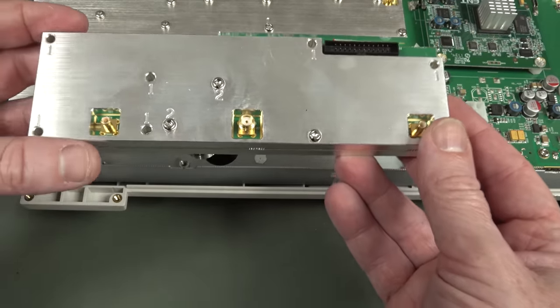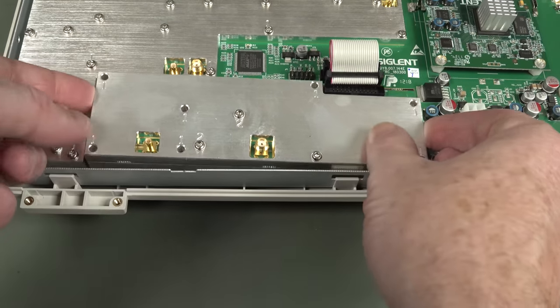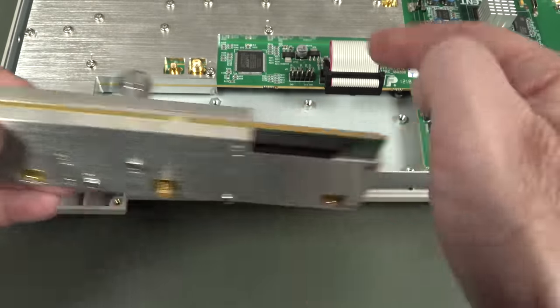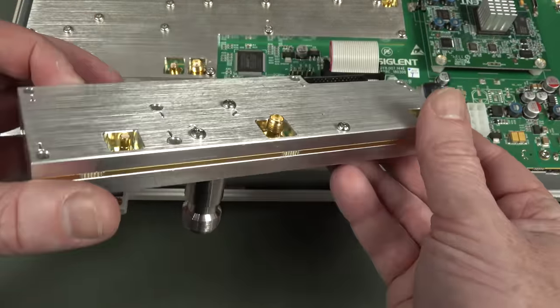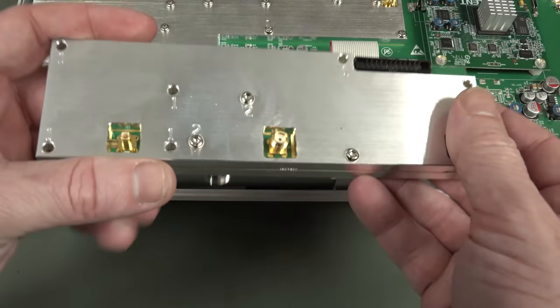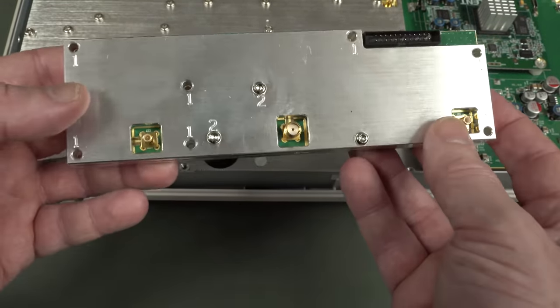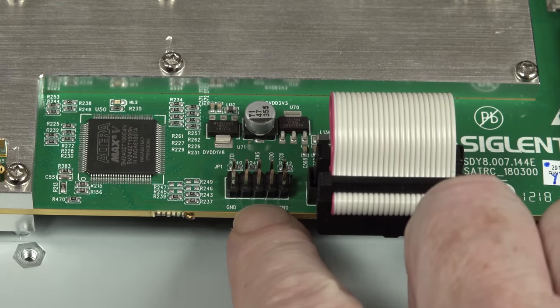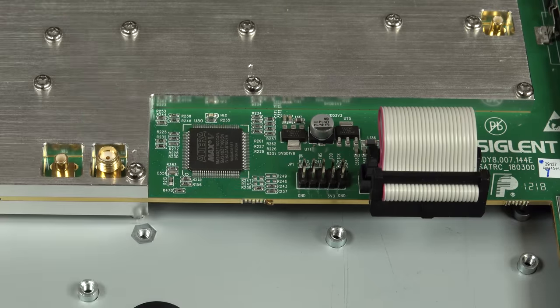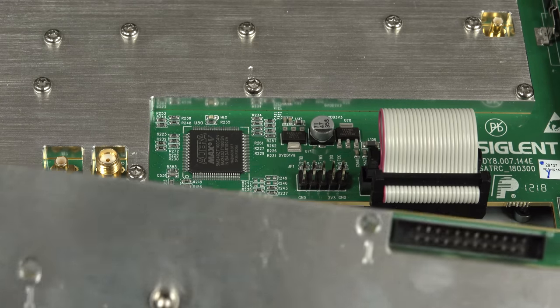There's no reason to do this electrically - you could have just left the mouse bites connected. But they've decided to break this out as a separate module, presumably because it's tested on a separate test rig and it's just easier for them to do that. We've obviously got a JTAG header here for the Max 2 PLD - it's probably just doing some glue logic housekeeping. I don't think it's powerful enough to do any real processing, otherwise they would have used an FPGA instead of just an Altera Max 2 PLD.